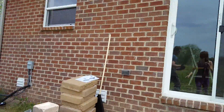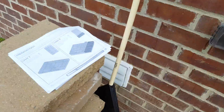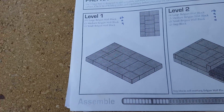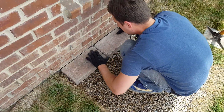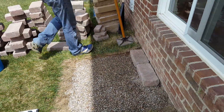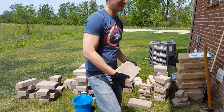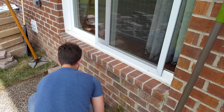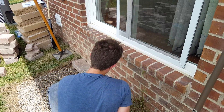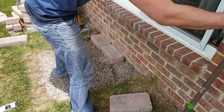Look around and see if you can find ones that have really busted-up edges on all sides — those go in the center. No one's going to see your dead center. It's very critical that you put it so it's close to the surface. I'm seeing a little bit of riser activity, so I can't fit them together. You can use a rubber mallet too — that might be more ideal. Now one for the end. See how the edges are crisp where the customer might see? It's too high because I didn't dig out enough, so we're going to go ahead and dig ourselves a little bit more.